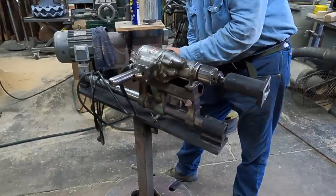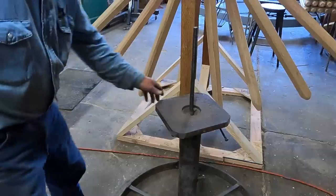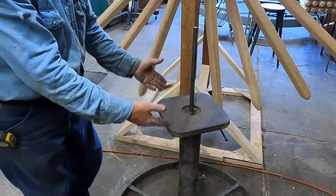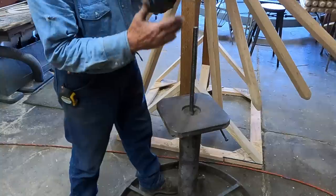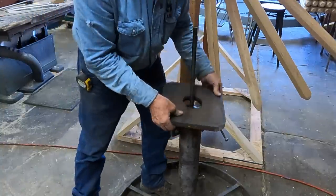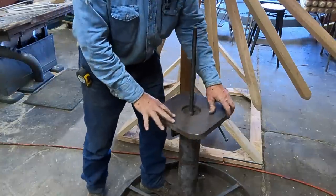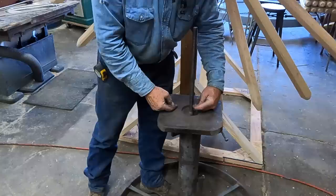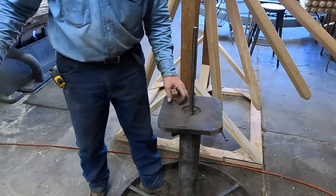This has about four and a half inches of travel, and I need to cut four, so that'll work well. This is the stand that I adapted — it's actually on the base of the stand that I set tires on. I take that head out and then I have this that I built: just a heavy one-inch plate, and I have that greased so it'll spin well. So I'm going to measure five feet from the center here, roughly, out to the tip of my tenon auger.